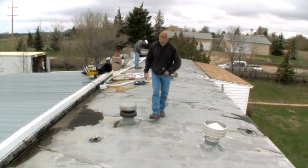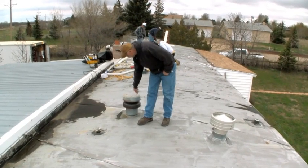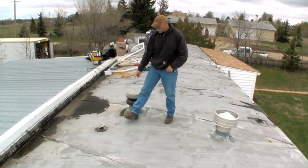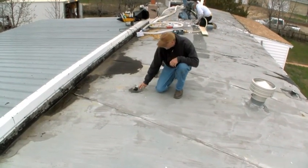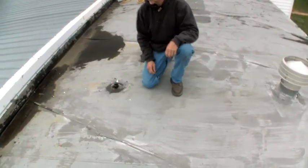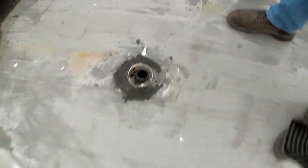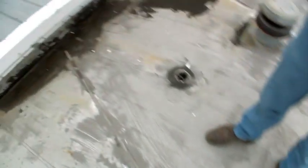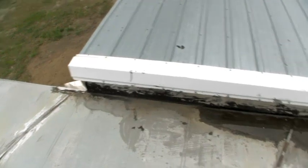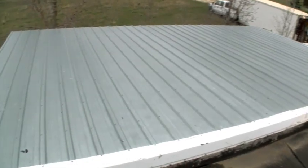While we're up here, we visually check any cracks. Sometimes the furnace flue cap will be rusted through. Another thing we look for is the vent pipe — the sewer vent pipe where it comes up. This is a sure leak here. When you see something like this, make sure you patch it, because once you're up here, you basically own these mobile homes or whatever house you're working on. Another spot is where water is settling — you've got a runoff, you've got an addition here. We want to seal that real good and make sure we don't have any leaks along there.